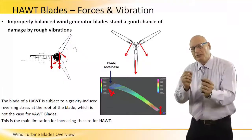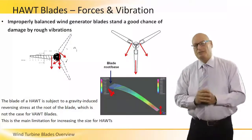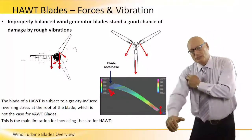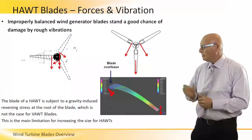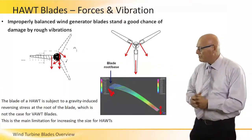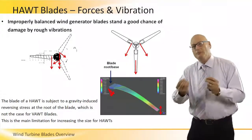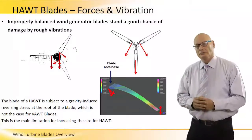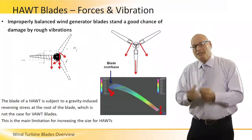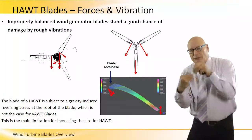But the center of gravity on each blade is in a different place, creating different stresses on the weak points, as we've seen in the picture on the left. At that particular position of the three blades, there are different vectors of forces. Each blade has a different stress on the knuckle. That means the knuckle sees different stresses coming from all around it